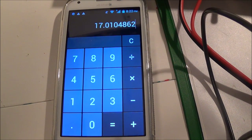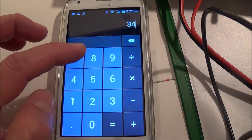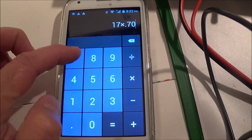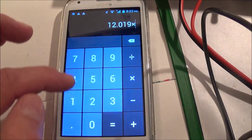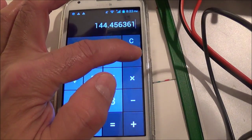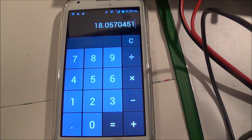That's what this receiver is actually putting out. I'm not sure exactly what it's rated at, but it's probably rated around there. If we're a little bit generous with our measurements and take 34 volts peak to peak — divide by 2 equals 17, times 0.707 gives an RMS voltage of 12.019, then multiply that by itself: 12.019 × 12.019 = 144, divide by 8, and that would be 18 watts per channel, both channels driven, with a 1000 Hz signal. So let's say it's putting out around 17 to 18 watts per channel.